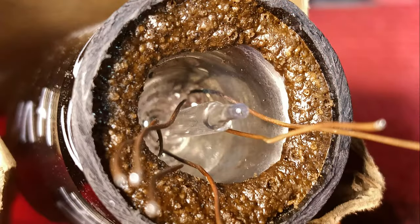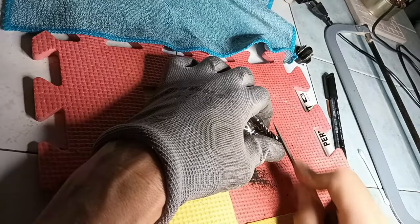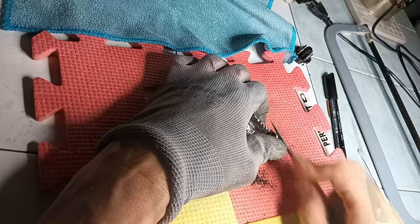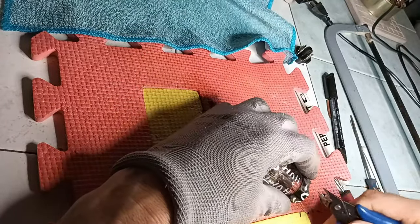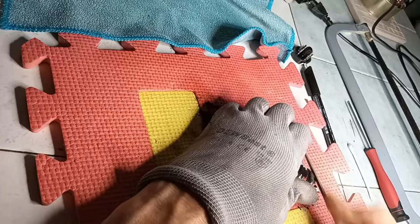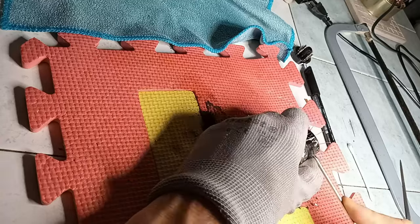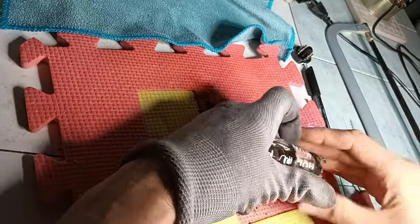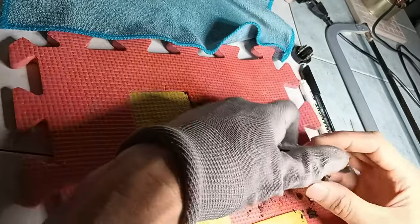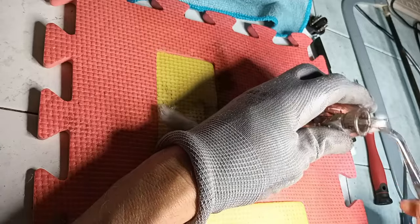Before touching the copper wires sticking out of the glass envelope, it is necessary to take a note of their sequence before and after the evacuation pipe. To remove the remaining base ring, a small triangular file is used, paying very much attention to avoid touching the glass envelope. The space between the terminal copper wires is carefully cleaned with a solvent.